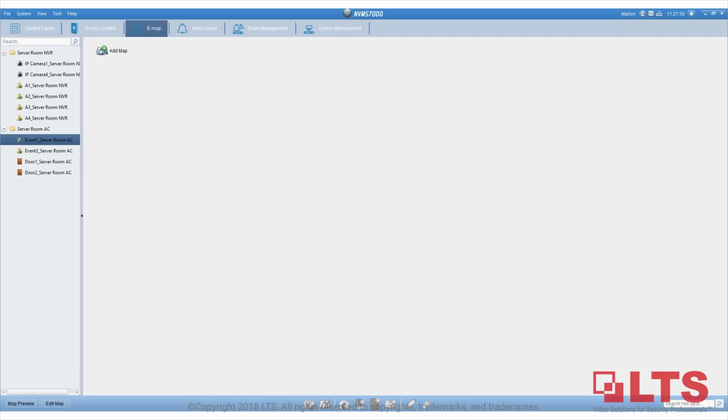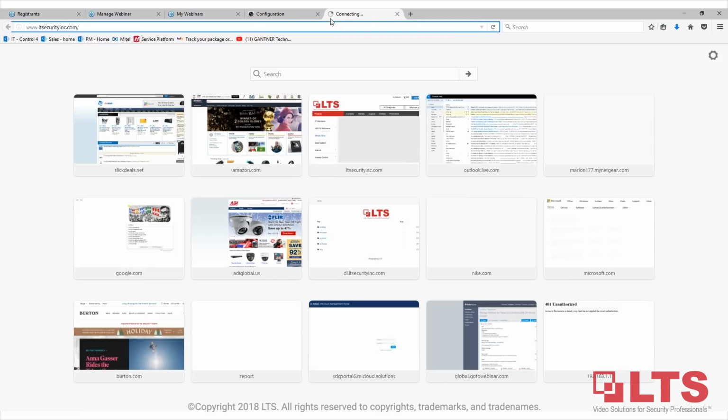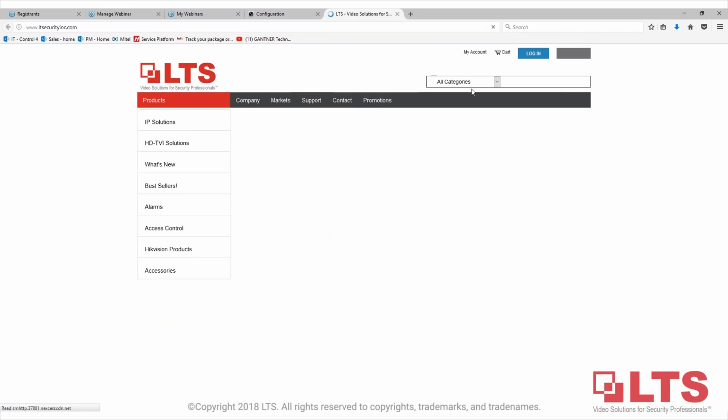Steve, did you say it has 110 power rather than DC12 for transforming? So basically, Steve, the power from the outlet to the controller is 110, and we have the 110 transformer and then converted to DC12 for the circuit board. So it's 110 and then to DC12. Do you have the specific PDF on your website, Francisco? I believe we do. If not, that's something that we can make sure we will have.